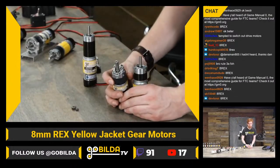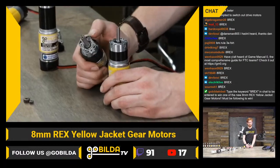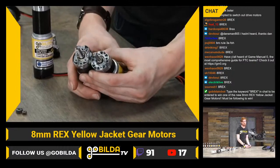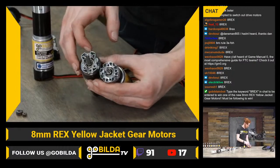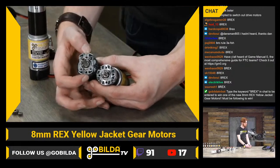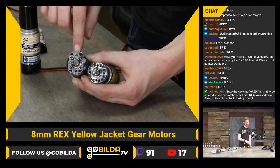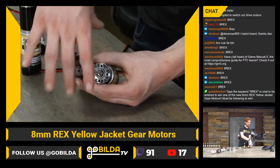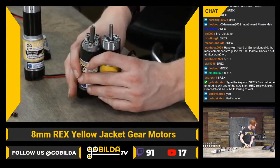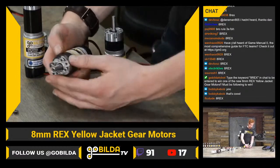There's also clearance for four screw heads — we've got the motor bolted to a piece of low side channel with a go-tube bolted alongside, and you can see the screw heads just barely clear that gearbox output. There are also six threaded holes on the end of the gearboxes instead of four. The familiar four holes are on the same 16 millimeter square pattern, but there are two more on an eight millimeter grid in case you want to mount with beams, and you can fit a whole beam into the recess if you want two wings off the sides.